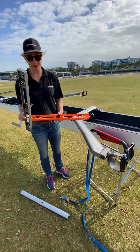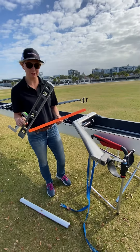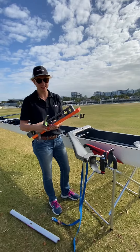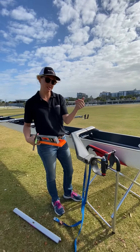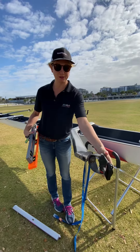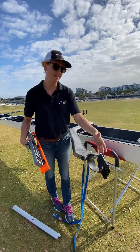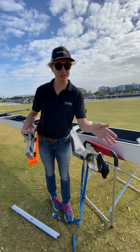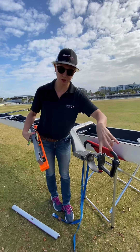The first thing you're going to do is level your hull. There are two things to consider in terms of pitch: your stern pitch as well as your lateral pitch. The objective here is to zero out your pin so that you can control the stern pitch with your pitch plugs.